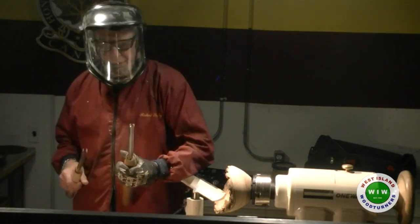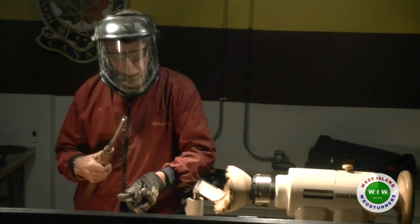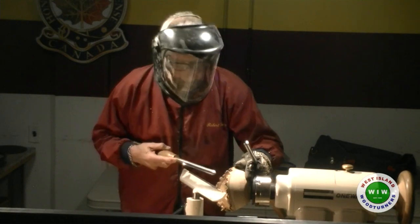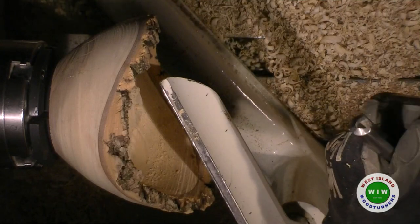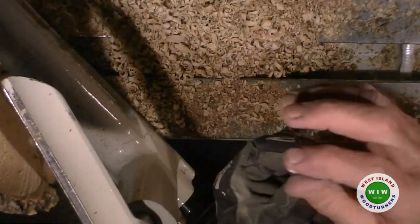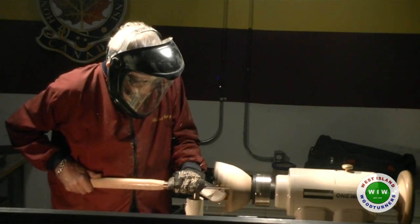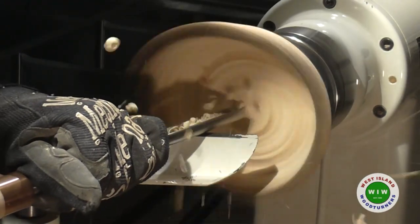As with any other relatively sharp, pointy gouge, it is limited as to how far you get round the corner, because when you get round here, you're coming off the bevel, and you can't spin it any longer. This one is called a standard bowl grind, and that is 80 degrees at the end, virtually square. One of the guys on the internet calls it the bottom feeder. It's a bottoming gouge, because you use it pretty well square on.